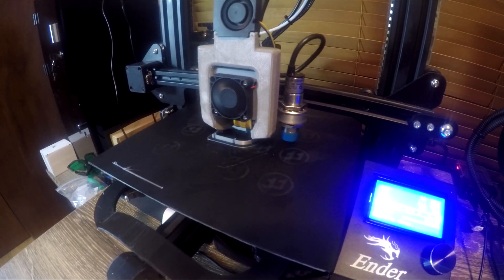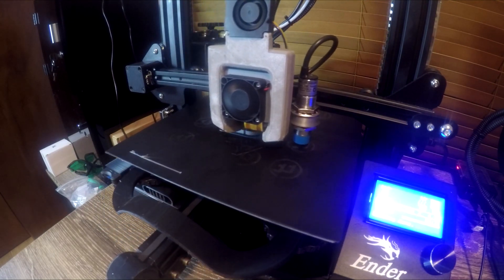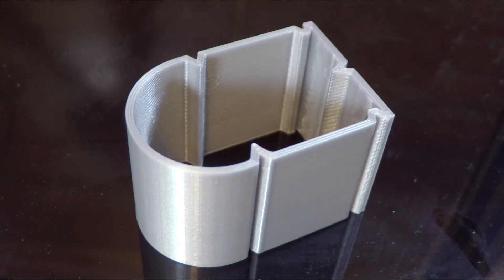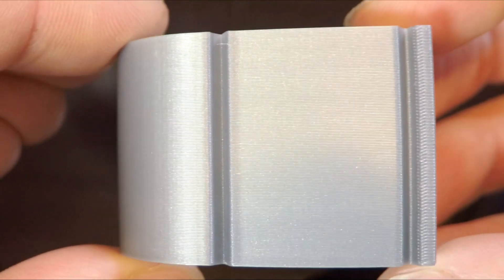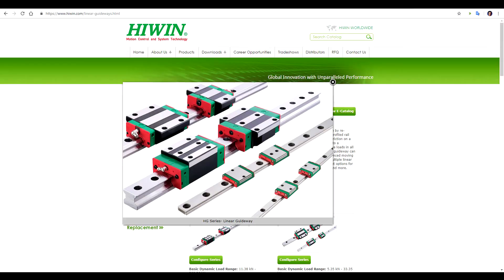Now it's only fair to state that during printing, the type of force I'm putting into the system with my hand just won't be apparent, and you can get some amazing print results even on really cheap printers like the Ender 3. You can see on this test print that the extrusion is very even and there's minimum artefacts such as ghosting. Sometimes, however, you might need more precision for certain situations. And that's where linear rails come in — they have tight tolerances and offer minimal wobble.